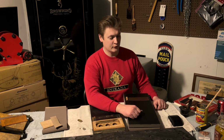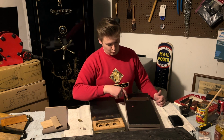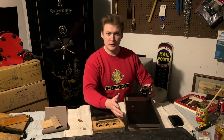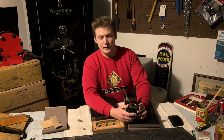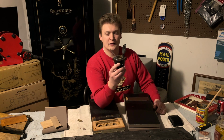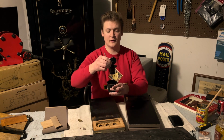And that is the type of glue that was traditionally used in piano building for gluing wood to wood, wood to leather, cloth to wood. And I really have a lot of fun working with it. Most people that work with hide glue will use an electric glue pot, and that works just fine. But I really have a good time working out of this late 1800s, early 1900s Farmer glue pot. It's not electric, of course. It's just two little cups that nest together.